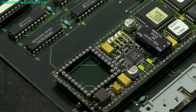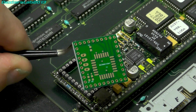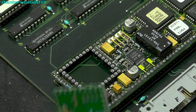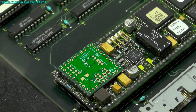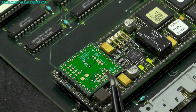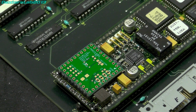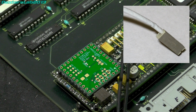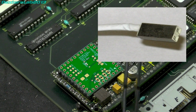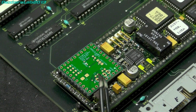So what's going to happen is I'll be mounting the CLC 020 on the back side of this, with a few passives, and then that will sit on there. The reason why I ended up using a 2-pin header to transmit the SDI is because that's what Quantel used on this originally. There is a really, really bizarre 2-pin coaxial socket which actually plugs onto these pins here. I didn't really want to start messing around creating new cables and stuff, so I thought, well, I will just add some pin headers onto this board here.